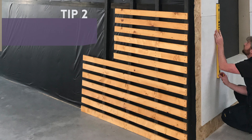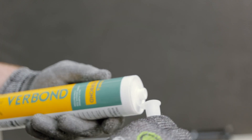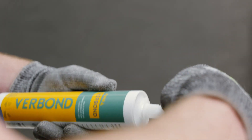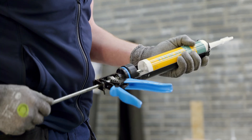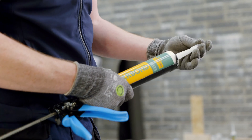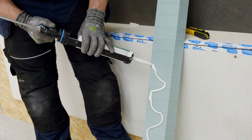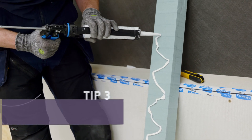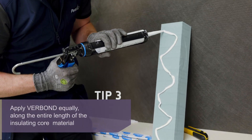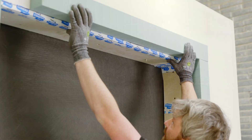We will install Almavert in front of the wall after measuring the window opening and cutting the panels for the required length. The panels will be bonded directly to the surface using Ver bond hybrid based adhesive. It allows for superior adhesion, features good weather resistance, and can secure durable tension-free structural connections. Apply Ver bond equally along the entire length of the insulating core material, then mount the top panel system and press firmly for securing the adhesion.